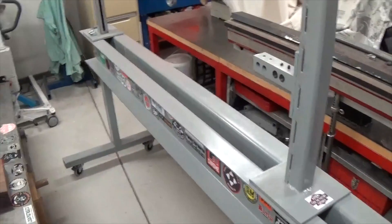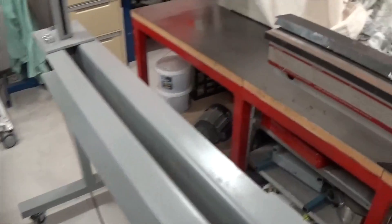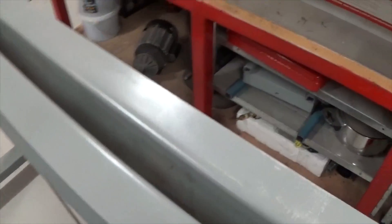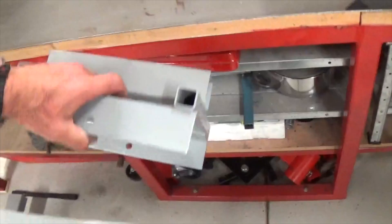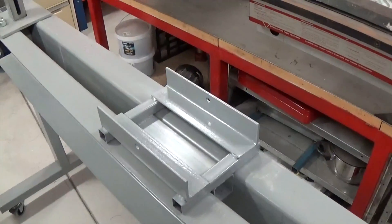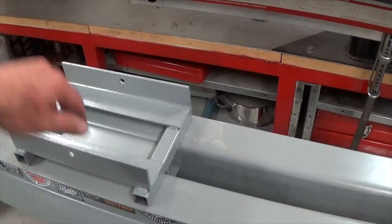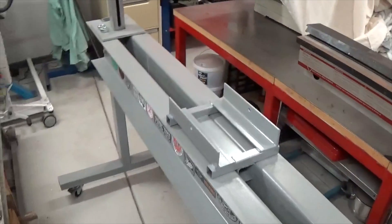In most of these designs you'll see they have a channel that runs up the centre, and the idea is you can cradle the frame in here. This really allows you to slide a cradle in and out. This particular cradle I built for XS650s — it picks up the lower engine mounts and clamps down here, and clamps the frame in as well, so it does a good job of holding the frame in place while you're doing your welding. That's obviously adjustable — you can move it where you need to.